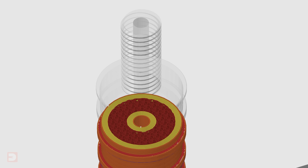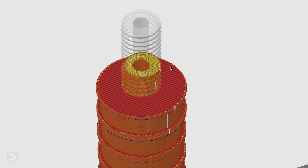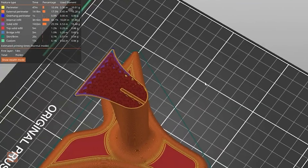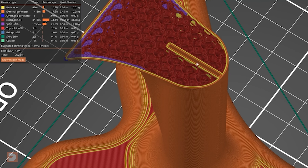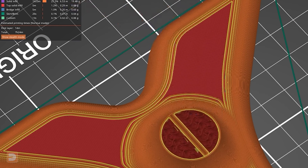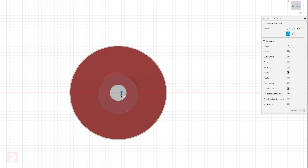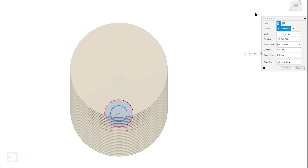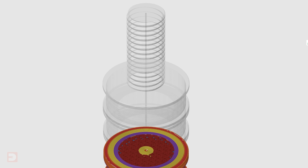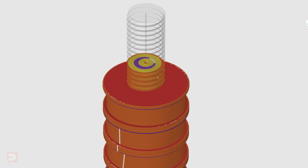This was because I didn't feel the rod was necessary for strength, and featuring the hole would make the thinner parts of the design — especially the screws — extra thin. This is despite it adhering to the trick I covered in an earlier video, where adding a negative volume inside your model can actually increase its strength, as it will add additional walls around the negative volume. However, that's more useful if the negative volume is closer to the outer edge of the model, so the new walls are directly connected to the exterior walls as a continuous extrusion. With these parts being relatively thin already, it doesn't offer a huge help, so I made a compromise: I kept a very small hole in the same place to allow air to escape when screwing together, preventing air pressure build-up, and this still added additional walls down the centre.